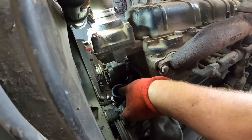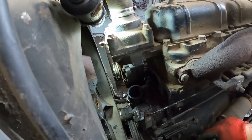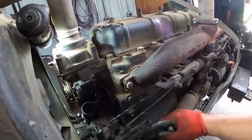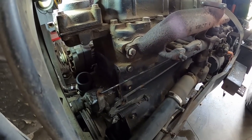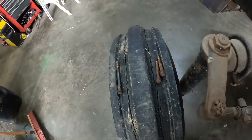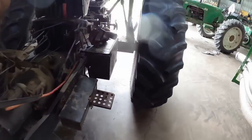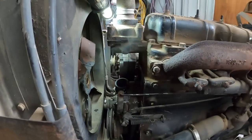Okay, let's see, new hose there. I had some stock hose around that was 2 1/8 inch. At least that's what fit. Surface cleaned up, chased the holes with a tap for the water pump. Got the bolts there, and they got the anti-seize on them. Water pump's ready to go. Gasket's doped up. I do believe she's ready to go back in.